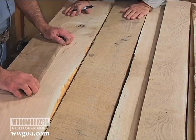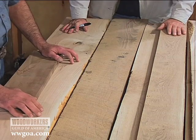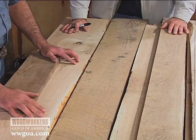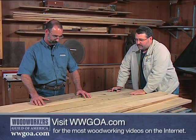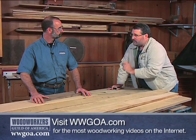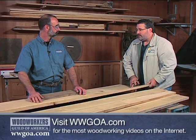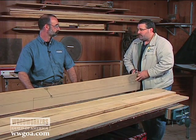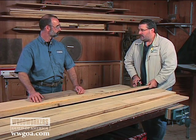This board has been through our double-sided planer. What we do typically when we sell lumber, do additional machining, or make moldings out of it is take our rough stock, which would look like that piece there, and put it through a planer to get it to a consistent thickness. We typically shoot for a 1/16 under nominal dimension. So if somebody's buying some 4/4 lumber, we will hit and miss it to 15/16.